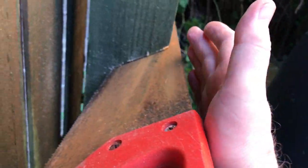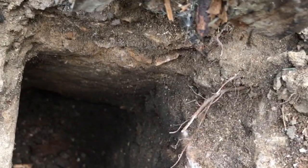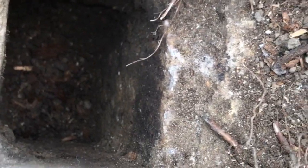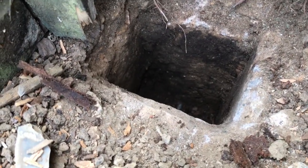I'm cutting it off at this angle here. The idea is I'll be able to push another post into the floor and then slide it into that gap and match the two up together. Obviously if I cut it in the other direction, I'd never be able to get it in. I just got to cut through the rest of this and it's damned hard work. Here we have a perfect concrete hole and I'm just getting the rest of the rotten wood out of the bottom. Quite a bit has come out. Then I'll get some wood, slot it back in there, and fasten it up onto the fence. This is the cut I made, so I'll do a similar cut on the new piece and then screw that together and also bat on either side of it.